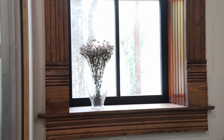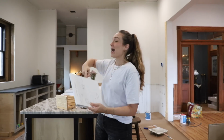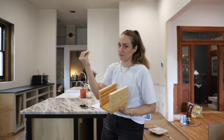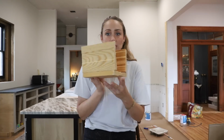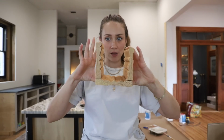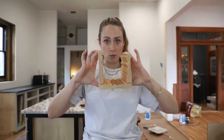I've been kind of doing the math on the beams. What are we gonna need? How big are they going to be? How big are they gonna feel? I don't know. We measured, and we know that it's 14.5 foot from wall to wall. So that's how long we need the beams to end up being. I couldn't imagine it, so I made a sample. It would end up being a 5-inch to fit perfectly, 5 1/4 to give a little bit of breathing room. This is essentially, not this side, I cut it too short. But that's essentially how, with this board, the beam would look up there.